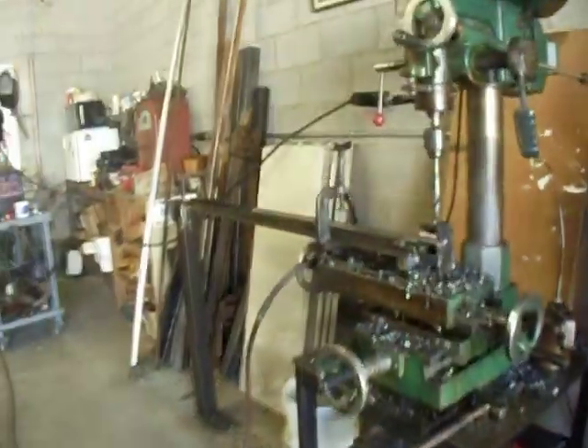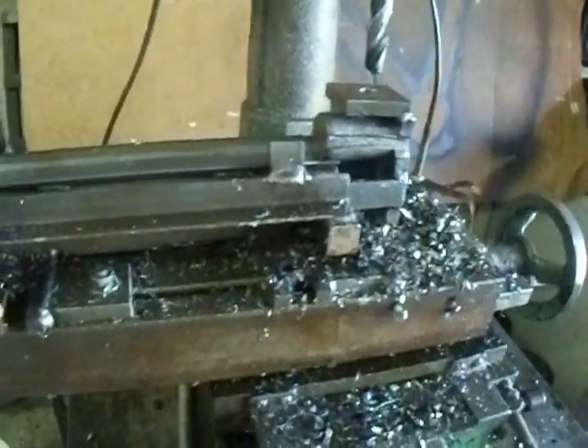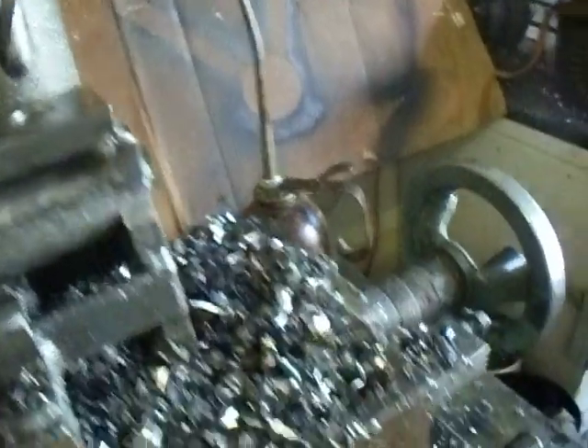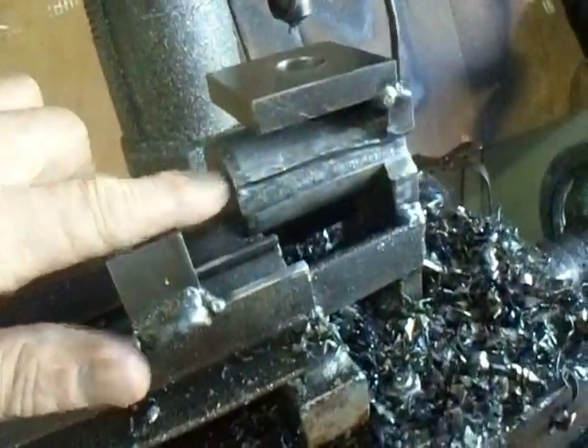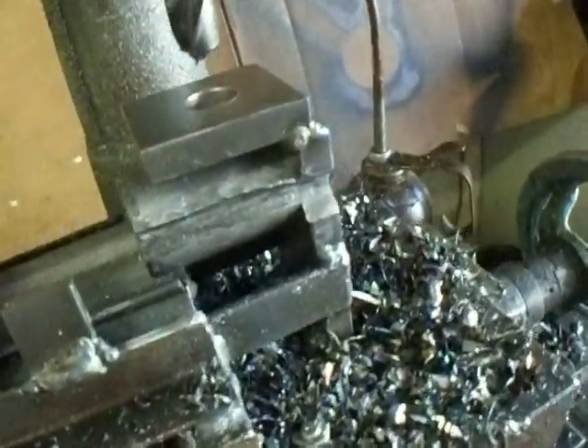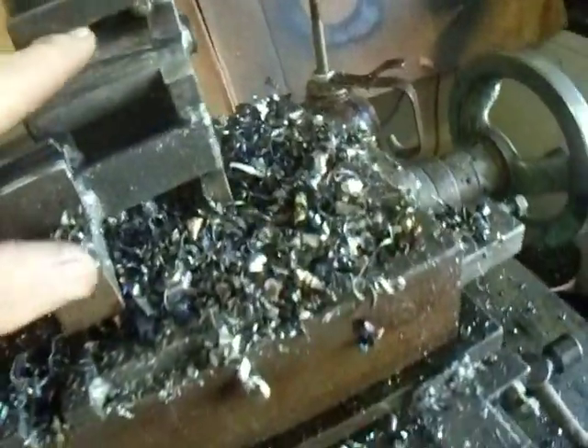I made up this jig. I don't know how well you can see it, but this is mounted to the table — welded together and all — just a piece of angle iron. This part right here goes inside the tubing. This groove is for the seam inside the pipe. There's a groove on the other side as well. This guides it through.